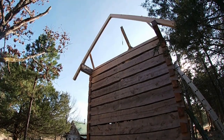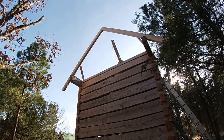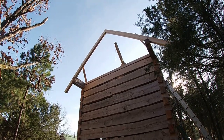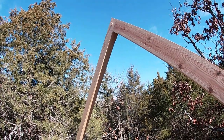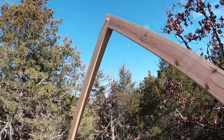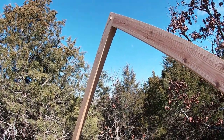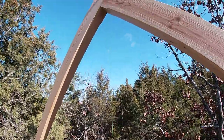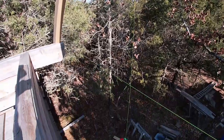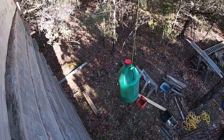I've got the first set of rafters up. These are the barge rafters and I knew that this set would be the hardest pair to set. But I got them up there and they're bolted down. I was going to show you how I actually plumb these barges — it's pretty much a poor boy setup but it works really well. I learned this from my log building buddies where we hung a string right at the peak and put a weight on the end of it. In this case it's just an empty jug of bar oil that I put some water in to give it some weight.